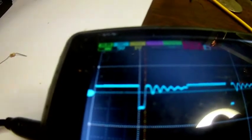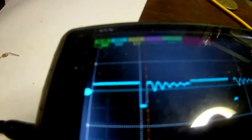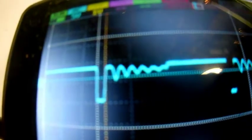Of course it's going to depend on your circuit — I might just use a 1K because it's more standard — but when I touch it to here, let's see what happens. I'm going to touch it. There, see that? The ringing goes away. So here's no resistor, and I'm just going to touch this. I have a clip lead from the drain — basically the high voltage positive — to the gate, which is driving this, and when I touch it, put that damping in there, it damps out that oscillation.